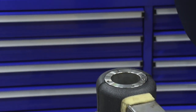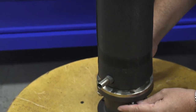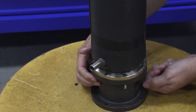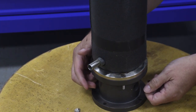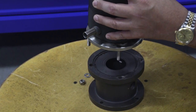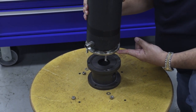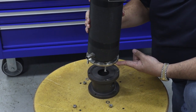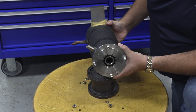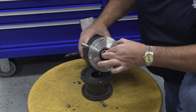I'm going to put this auger out of the way. On the bottom of the evaporator assembly you have four metric bolts — again four metric bolts — that you're going to loosen up and take off. Then the evaporator assembly is going to pull up off the base. When you've got refrigeration tube still tied to it you might get it about this high, but that's high enough to get under there and remove the lower water seal or lower bearing. I'm going to flip this over so you can see that lower bearing on the evaporator, and I'll go ahead and remove it.